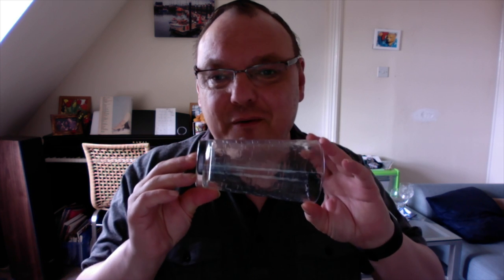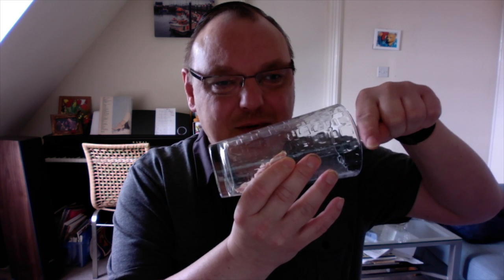The way that PMC get around this is that front baffle, okay? The baffle is the piece of wood that the speakers are mounted into. And as I showed you, it slants. And so the speakers slant. So now, anything that comes out that way, whoosh, like that, actually doesn't meet with sounds coming out that way. And that way, the sounds that come out of the back of the cone come round to the front and subtly reinforce the forward standing waves, okay?